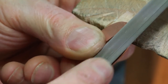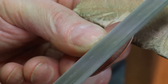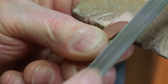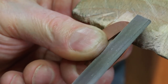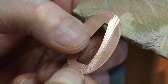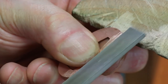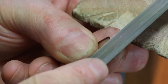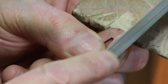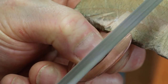I'm using my thumb just to guide the file along the face, and I can see where it's not catching and bring the file in there to touch it. I can see how it's starting to look a little bit like scoured wood or a really heavy rain shower. I'm going to do that whole section now — just gently controlling the file, pushing against my thumb and moving across the piece. I'm making sure I'm really covering the metal with a very light touch, just creating a texture, and I can go back and put in a little deeper grooves here and there so it looks a bit like a piece of wood.